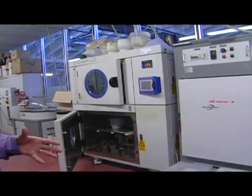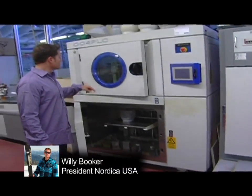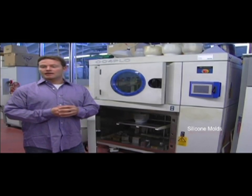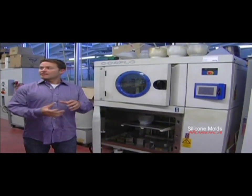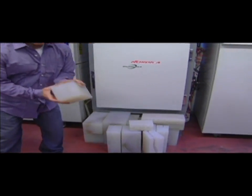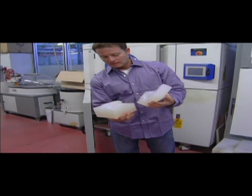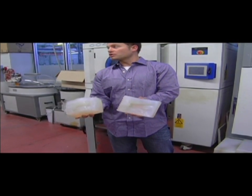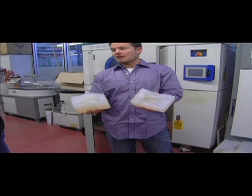The process begins with the construction of a silicone mold to produce the first version of the boot. The first shell will be built from resin for fit testing. You would take your prototype and then pour silicone around it, ending up with a big block of silicone. You then cut it open to get a silicone mold, which you can use to mold a few test pieces out of resin.